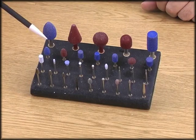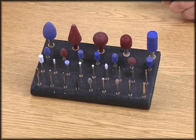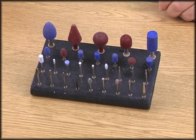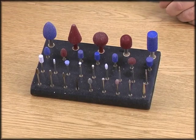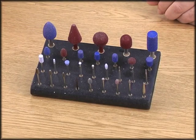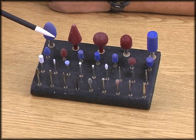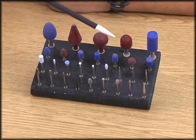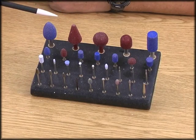Then there's the 1/8-inch. As you're roughing out the work to begin with to waste away, you'll be using the 1/4-inch, because these are the ones that introduce the power, that allow you to remove the most all at once, because there's more surface to grind away because of their size. Then as you begin to reduce the size and introduce detail within the carving, we'll go to the 1/8 shafted bits of various shapes, and begin to refine the rough shaping that we did with the larger bits.